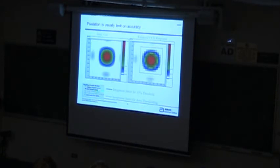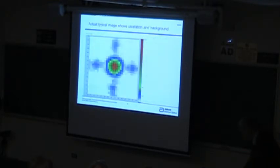There's another one, we call it area threshold, which is a little more sophisticated. What we do is we find the location between these side lobes, and we essentially draw a box at the minimum place around there, and we keep everything inside that box. And so we are excluding this now based on area rather than on a height. And this is the one we found actually to be the most accurate algorithm. In real life, of course, you've got noise. That was a simulated image. But in real life, these things are not quite as distinct, and they're a little harder to find, but they still could be found.